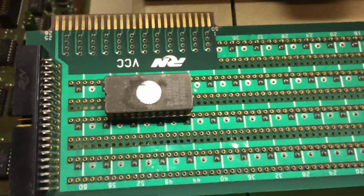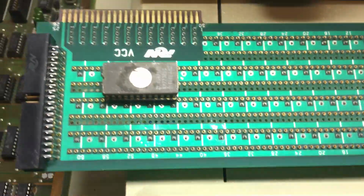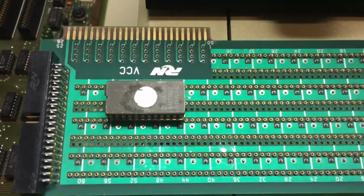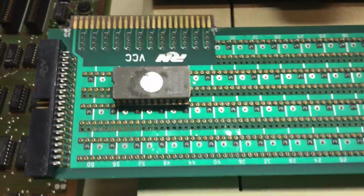Yes, copyright infringement. Okay, hey, I'm just playing around here hacking. Plus, I think they released the ROMs now. Anyway, I burned the Apple monitor ROM in here, not knowing that if you don't have the AppleSoft Basic in there, it won't work. But it wouldn't boot up anyway. It would basically give me something like this. It would just come up with goobly gop.